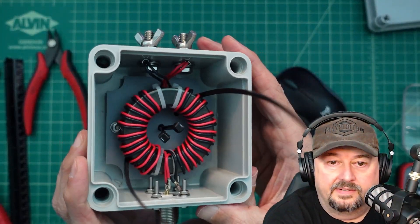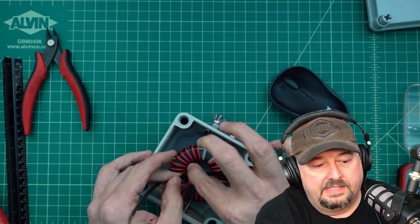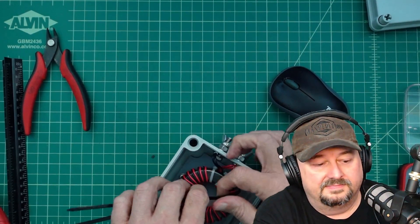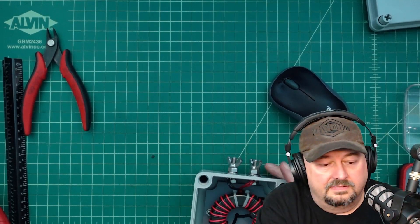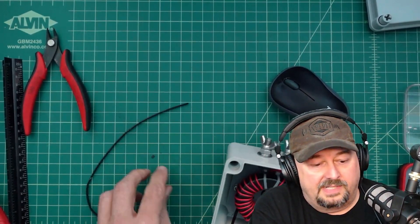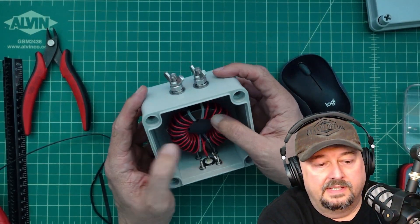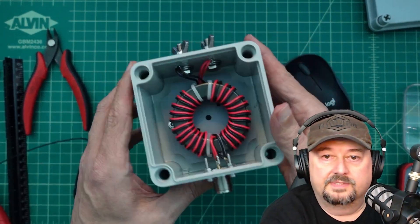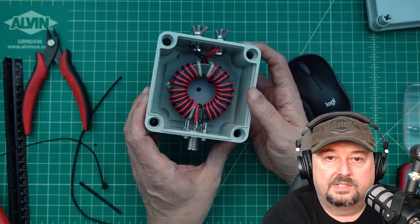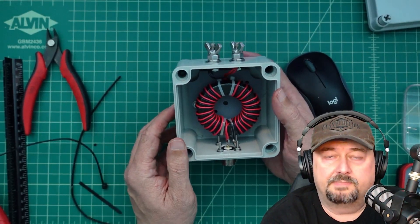I have that pin soldered in - I feel pretty good about that. I'm going to go ahead and cinch down these zip ties to hold everything secure and steady. I got one in there backwards so it's not going to lock - we've got a bit of a problem there. I'll just go ahead and yank those out. It's a tight fit in here, so I'm going to say that the zip ties didn't work out. I really wanted to use them to hold the core down but I don't think it's absolutely necessary. At the end of the day, this is the choke we're going to use for our doublet antenna. If you have any questions, comments, suggestions, or recommendations, go ahead and post them below and I'll do my best to respond. Thank you for watching.